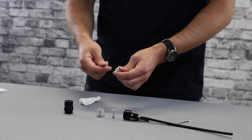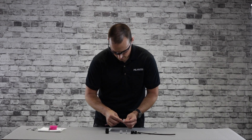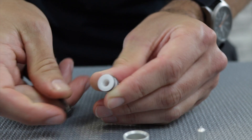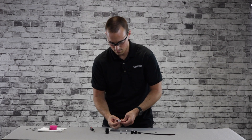When removing the rear o-ring, you're going to slide in next to the o-ring and pop it out of its groove. You don't want to stab the o-ring. Once you've popped it out of the groove, just hook it and pull it straight out of the back. The external ones are a lot easier — just pinch those aside and roll them out of the groove.